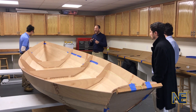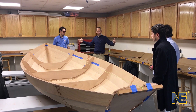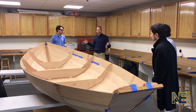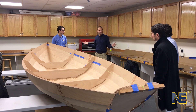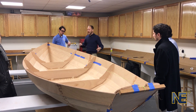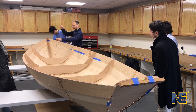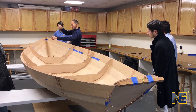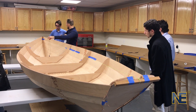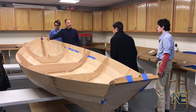Now you have it. Whatever size your paper is — because everyone's got a slightly different size paper — with your drawing area, you've got the length of your boat, so now you can make that ratio for what scale you're drawing to. Once you've got that scale laid out, we know that's station zero. How far back from station zero is station number one? Now I can get that measurement. It's actually fairly simple once we start doing that.